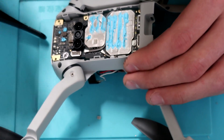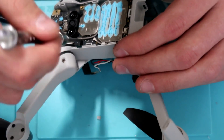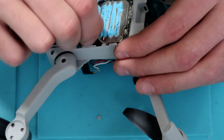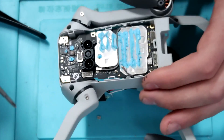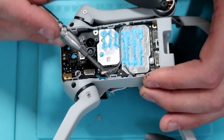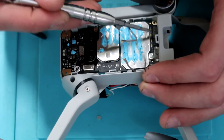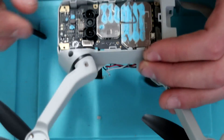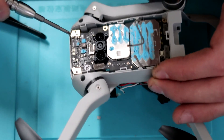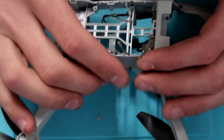Now that we have that removed, you can see all the thermal paste covering the electronics. We're going to remove these antennas which are connected to the feet — they're held in with little UFLs, so just go ahead and break those free. Be very careful with these; I've had them break on other drones, so be gentle and make sure you don't rip the connector right off the board. That one is tucked in between two electronics. Now that we have access to the ribbon cables, we're going to remove those as well — there's one more located next to the vision sensor — and then pop the flight controller or main board out of place.